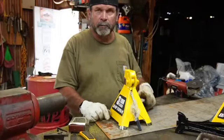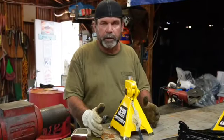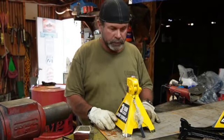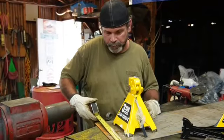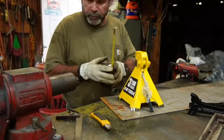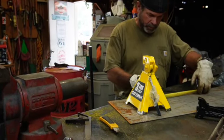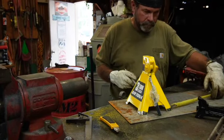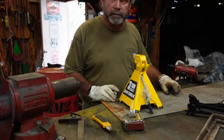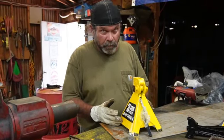We've got the powder coat ground off the legs. Obviously you can't weld through powder coat — it's kind of like welding wood. It doesn't really matter how big a footprint you make here. The main thing is you just need to be outside the envelope of what this base is. I went to the scrap yard and picked up a piece of scrap 12 inches wide. I'm going to come in three inches on that side — the length is two — and then come another three inches out here. We'll make our cut, get this welded on, and duplicate it on the other side. What we're ultimately trying to do is make sure all of these things either move together or don't move at all.